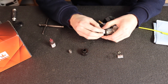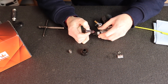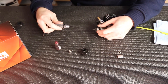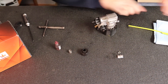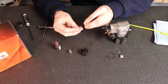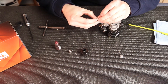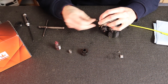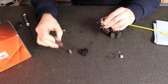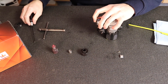For buggy I do have two different setups I go with. I mainly use the same one as for truck, but if I need a softer one I'll do all medium shoes and all medium springs. I repeat the process and put a little bit of Loctite on just before I screw the clutch pin in, so I can have everything lined up, apply Loctite, and then screw it in the rest of the way. Line the spring up with the little hole in the shoe, place the shoe in position, and wiggle the pin in — it'll all line itself up. The right clutch setup lets you have a good amount of power and good run time.